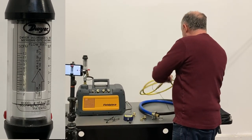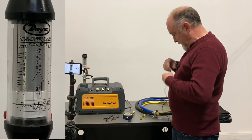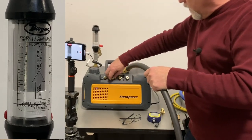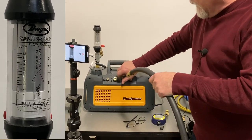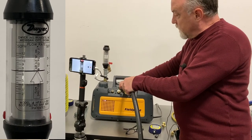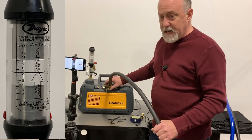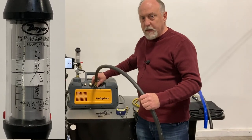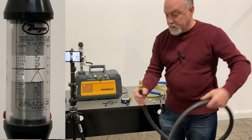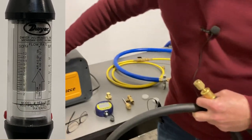Let's connect a competitor's hose — this is a three-eighths by quarter hose. The ports don't make too much of a difference here, as I showed at the beginning. When we connect this hose, it's pulling down to about 7 CFM — not bad, a tiny bit of loss with six feet of hose. The quarter-inch porting on the end is big enough that it's not causing a lot of restriction, and the flow at the 3/8 port is fine also.